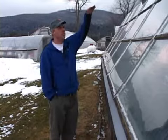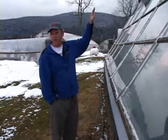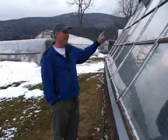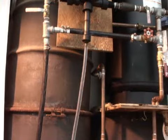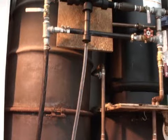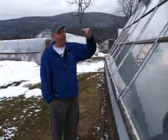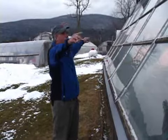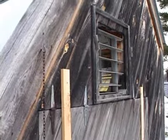The ceiling also has six inches of fiberglass insulation, and the structure looks a bit like a sugar house. It was originally designed as a passive solar house — before any mechanical heat was added, 50-gallon drums of water were placed in the back wall to absorb the sun's rays and protect the greenhouse from freezing. Ventilation was achieved by opening side vents so air would rise up through vents at the top like a chimney.